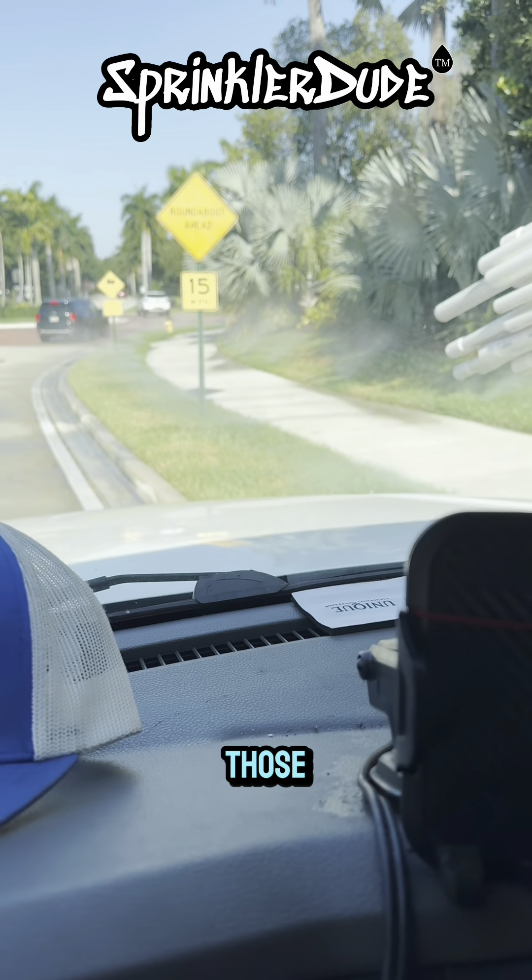We still have a zone on this property that's not working from the controller — and that was zone number six, remember from when you were filling out your paperwork? It's in this valve box here. Go ahead and open up that valve box. Pull out the little timer. Turn it to the other side where the buttons are. Hit the button pointing to the right. It's in the off position — that's not good. We're going to hit the middle button until we get it set to automatic. Unfortunately this was set in the off position, which is a problem.